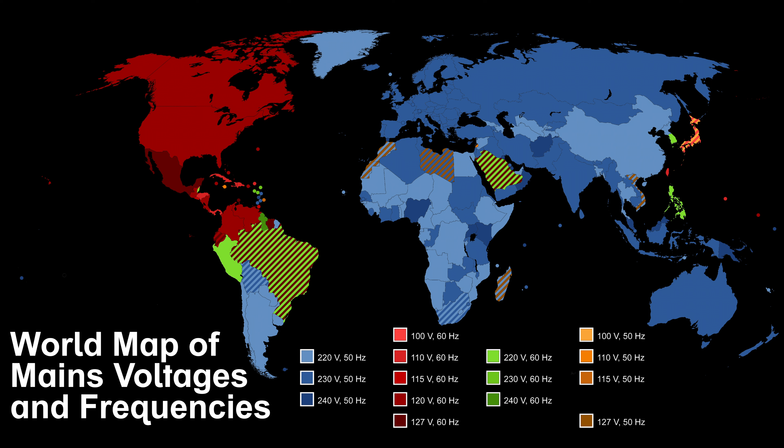That's why we use step-up and step-down transformers — because we have different voltages in our houses versus that piece of gear you got in Japan or purchased in the US or Europe. When it comes to frequency — 50 or 60 Hz — don't worry; they adapt. The important thing is the voltage. Be careful, because a lot of times voltages are close but not identical. For example, Japan has 100 volts — don't use 110. Look for output rated specifically at 100 volts. America is a little more fluctuating, like Europe, ranging from 110 to 120.